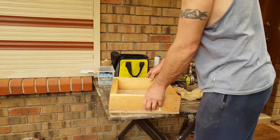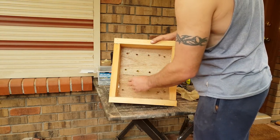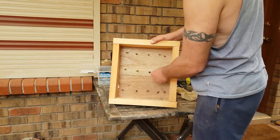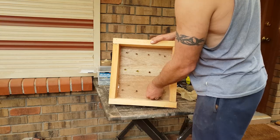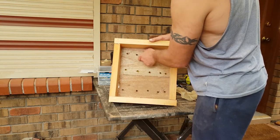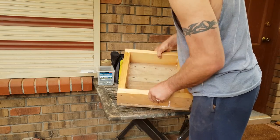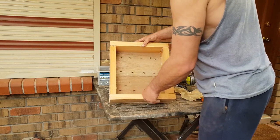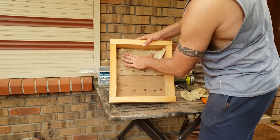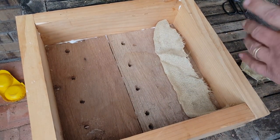So what I'm going to do now, ideally you could put a bit of gutter guard, really fine meshed gutter guard, or you could put in a fly screen across the bottom here. Another thing that I use, which seems to work alright and doesn't seem to block up, is I just lay bits of shade cloth in there over the holes. Okay, so I'll lay some shade cloth in there,